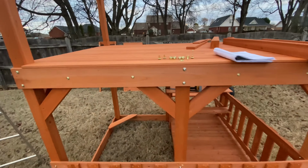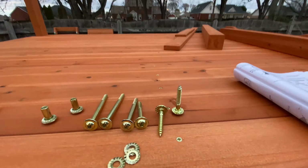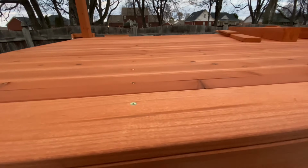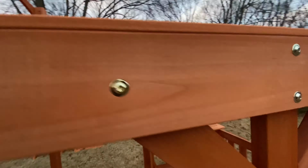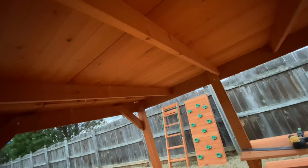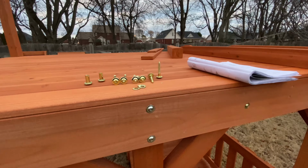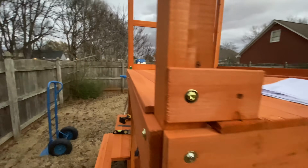The only thing on the step of putting the floor down is just make sure that you have this center beam and all of the planks lined up correctly. I'd already put down all the screws here, there, and there, luckily just on the first plank. But because of where it's located under here, off to the side of this piece, it's off center just a little bit. So just watch that. So make sure on this little guy that you've got it flush here.